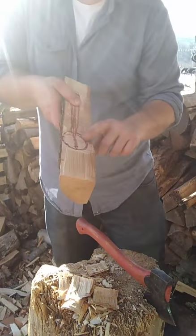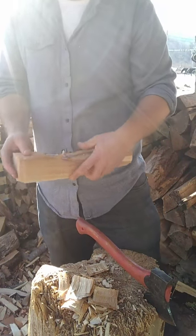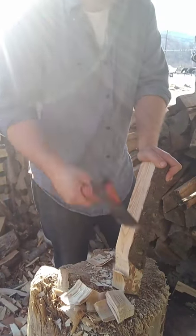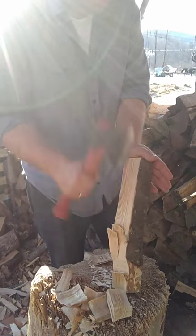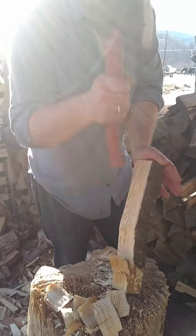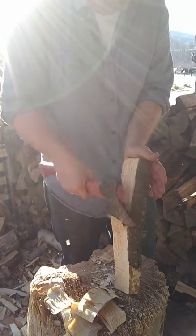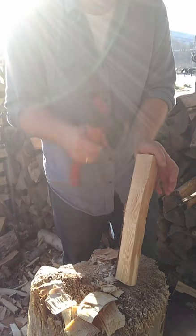When it comes time to get rid of this knot, I have to be a little careful as I axe it so that I don't split the wood into the bowl in a way I didn't intend. Down here I'm actually not as choked up on the axe so I get a little more force with my swing — I'm more forceful because I'm nice and far away from my hands. It is important that you turn your body to the side enough that should this bounce off, it's not going to hit you in the leg. Always be aware of what the possibilities are — that's absolutely crucial.